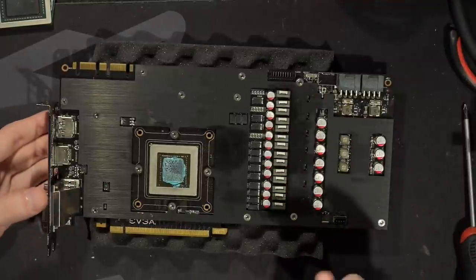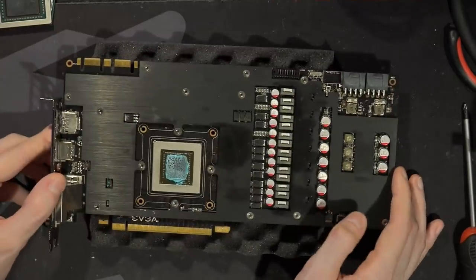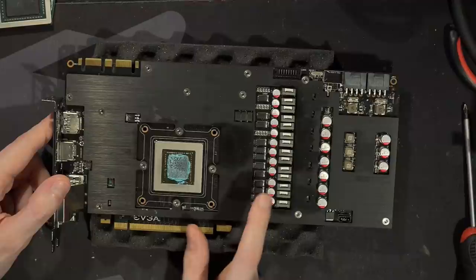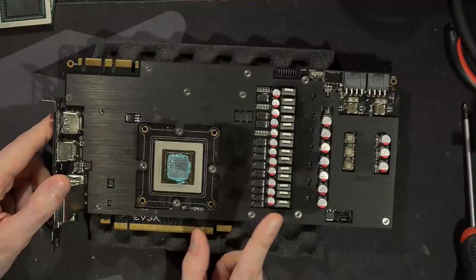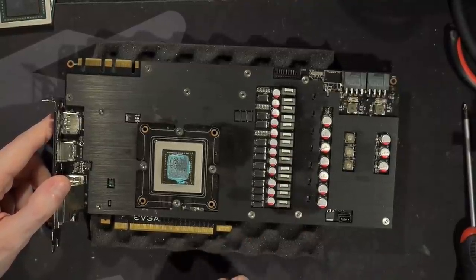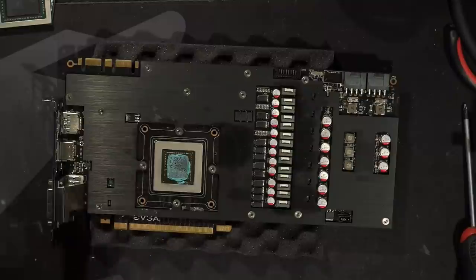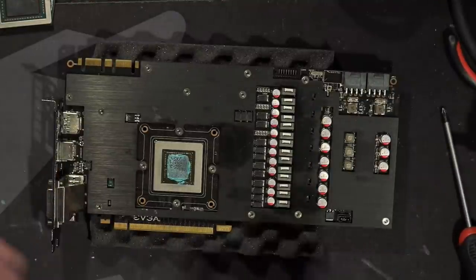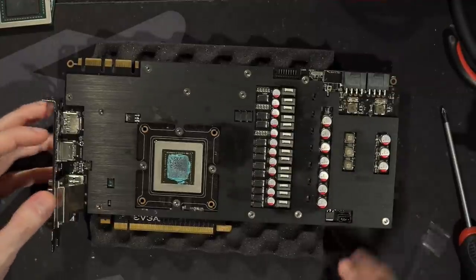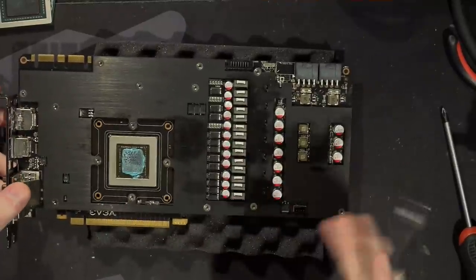It's a beast of a VRM, but EVGA likes copy-pasting it, and it makes sense — if you have a perfectly good VRM, why design a new one? The main difference between this and the Lightning is the Lightning technically might have more SMD aluminum polymers, and the Lightning is a true 8-phase whereas this is 14-phase with doublers. I don't think that really does anything — the Lightning might actually run a higher stock switching frequency. Without the context of the spreadsheet, everything I'm saying probably won't make any sense.